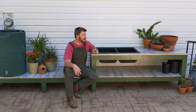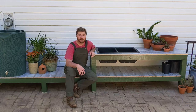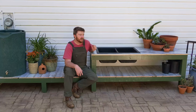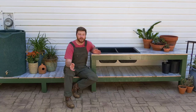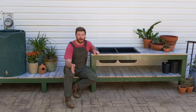I painted it and then I did a clear coat. The top seal on this is actually a concrete sealer — it's one of the only things that Home Depot sold that was recommended to use over paint. If you're doing this, don't use outdoor polyurethane over paint or anything like that; it's just going to crack up and be real bad. Over this video, I'll show you how I built it as well as a few tips and tricks to make sure that when you're using non-pressure treated wood, it's not going to rot out and fail fast.